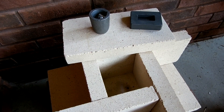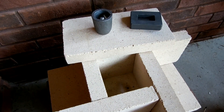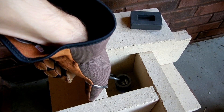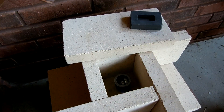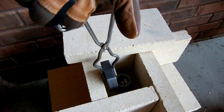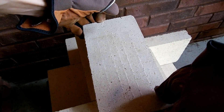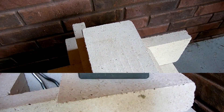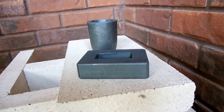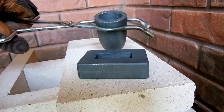The first metal we'll be melting is tin. I've got a couple of pieces of tin scrap from other things that I've done and didn't end up using. We're going to melt those down and recast them into a bar, so I'll put that into the furnace. It shouldn't take long at all for tin to melt. This is also the bar mold that we'll be using, and I'll put that in as well to heat it up and cover it. This tin has a fairly low melting point, so fairly quickly it's already completely molten, and now we'll cast it into a bar.